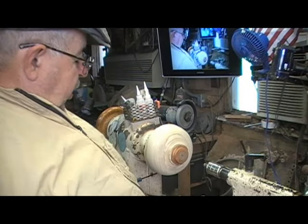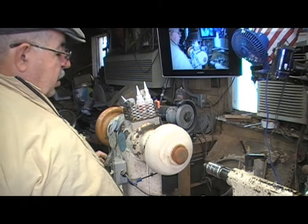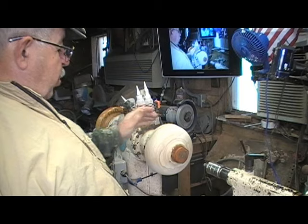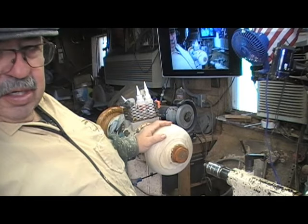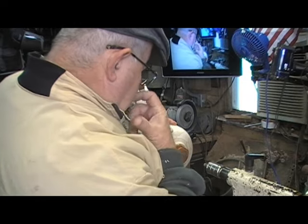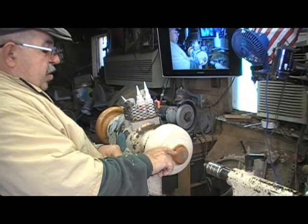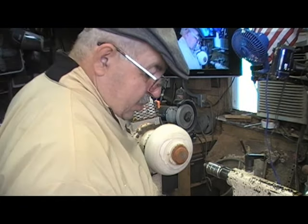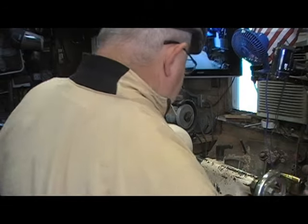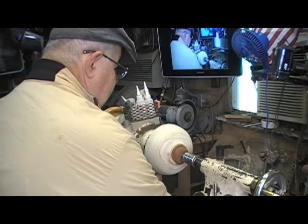Now, I put a small faceplate, and let's pretend, put on our pretend caps, and we put it on a small faceplate, and we roughed it in, and then we hooked up our glue block, and our glue block is right here, and it's running true. All right, for all intentions, it's running true, because I would true this up again once it's on there. I bring up my tailstock and make sure that tenon. Let's do it. I don't want to fake anything with you. All right, there it is.